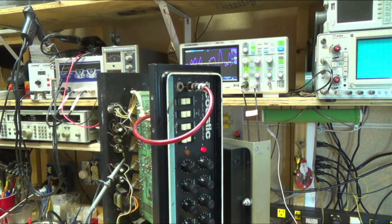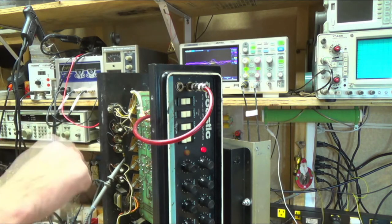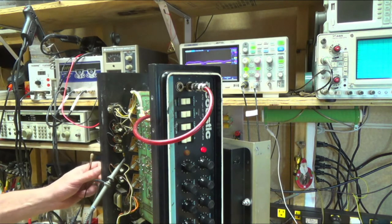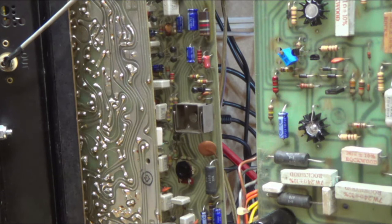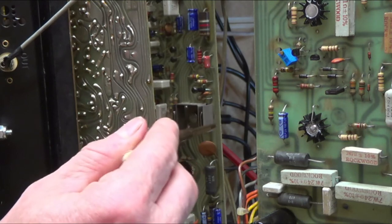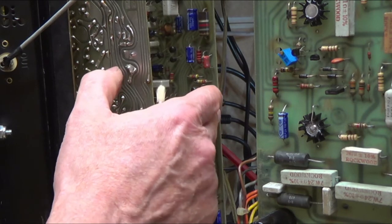Okay, so I got that new transistor in, and it does seem to get the amplifier for the reverb back up and working, but it's really noisy. And I think if, let's see, I'm gonna try to turn this if I can. So I've just got this thunderstorm that's going on with this reverb. One of the things that was interesting is that this transistor was really running hot before, and it's running hot again, right?